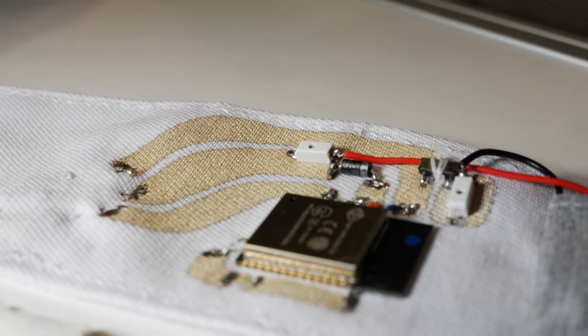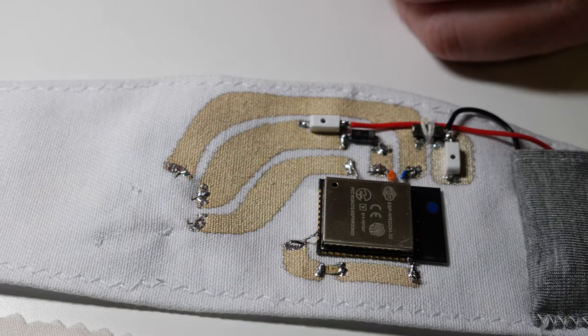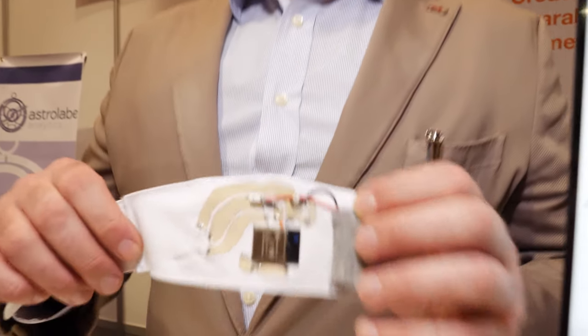This conductive layer gives us another unique feature: we can solder directly on it. We don't need to use low temperature soldering — this is common lead or lead-free solder with a soldering iron. The connection is really strong, to the point that the weakness is the fabric itself. If I try to rip this off, what I will ruin is the fabric and the soldering will still be intact. The process is a five-step printing process where we deposit chemistry on the fabric to create a catalyst layer, then the fabric is immersed in a bath which coats the fibers with a thin layer of metal via wet chemistry at the fiber level.